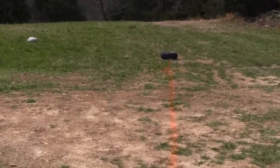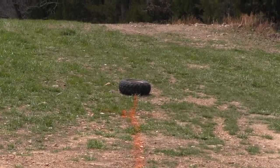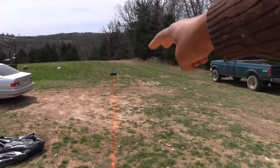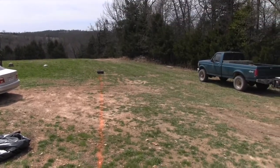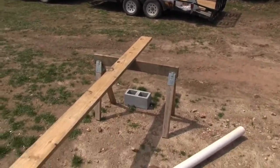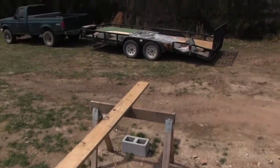From this central spot where the toilet is, you can see right there — it's about 60 feet out where that tire is — that's where our septic tank is going to be, because we're still going to be driving up in this area. We'll have the septic tank there with lateral lines heading downhill in that direction. We're going to build directly on top here instead of digging down for the pads, and we'll use rebar to support it.